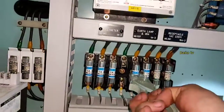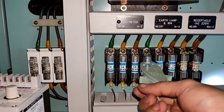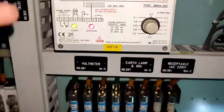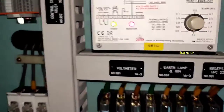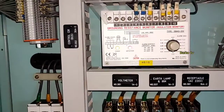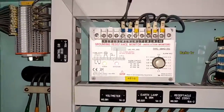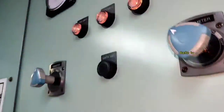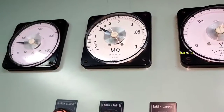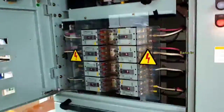Put back the fuse. After putting back the fuse and powering up, you can see the detection lead has popped up. It means there is a 220V grounded equipment. The maximum range is 2.0 Meg — that is the maximum setting for our monitoring relay — and currently it's reading 0.5 Meg, confirming there is a 220V grounded equipment.